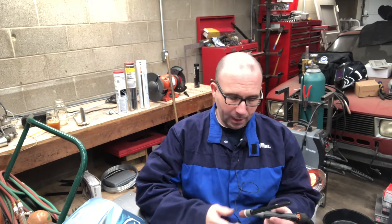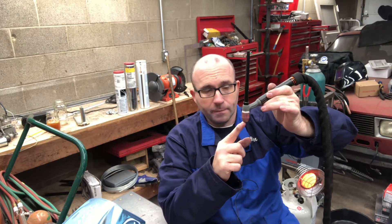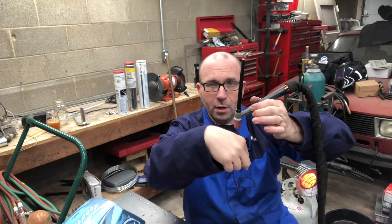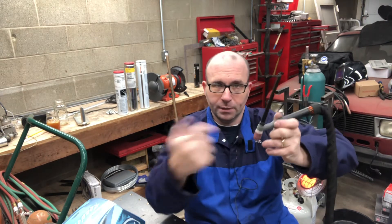The Venturi effect applies here too: if you try to push too much gas through the nozzle orifice, the flow becomes turbulent and as it passes through it draws atmosphere in from around the mouth of the nozzle. So you can actually get the same contamination from too much shielding gas as from too little — in either case it's atmosphere in the weld. The solution in that lab was to turn the argon flow down to 30 CFH, and the welds turned out fine.